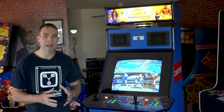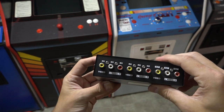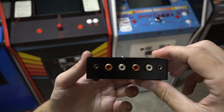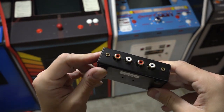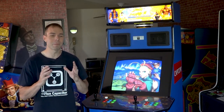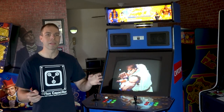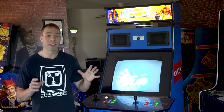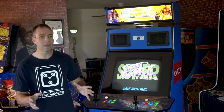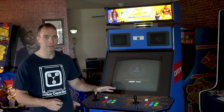For whatever reason, I could not get that to work cleanly. I tried a cheap one for about $15 and was getting all kinds of ground hum. Then I bought a fancier Rolls unit — supposedly super clean, US-made — and I was still getting a little bit of hum from the speakers. I spent hours, I kid you not, trying to troubleshoot that ground loop hum and just couldn't figure it out. Eventually it was just a time vortex and I could not spend any more time on it.